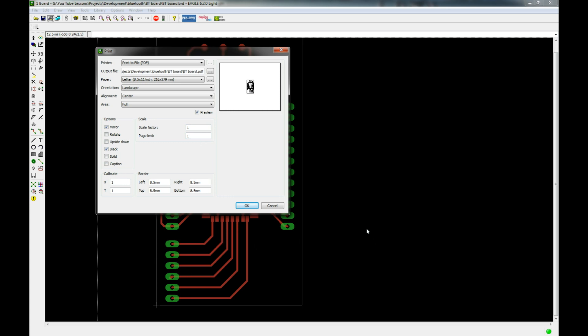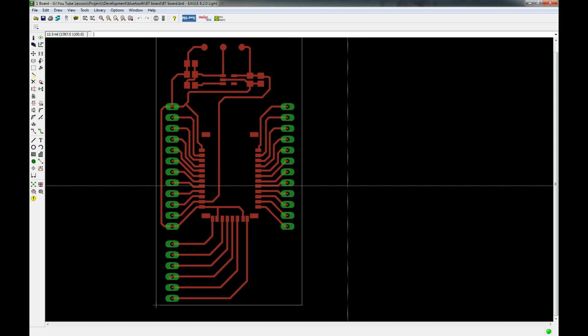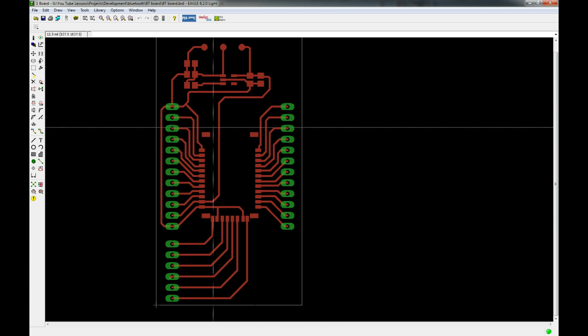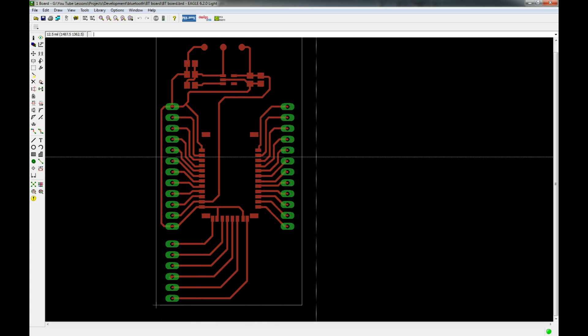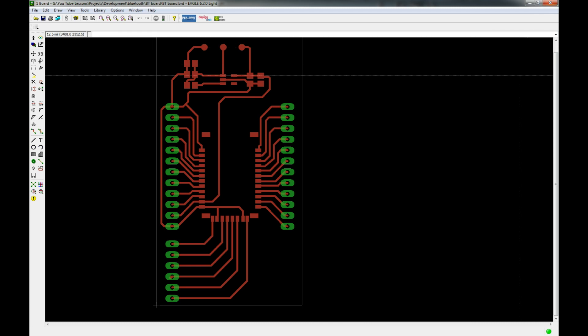Since you have to flip the board over to put it on the copper board, you have to print it out mirrored. What's cool about Eagle CAD is it has a mirrored option. The PDF you download from the project code link will already be mirrored, so you don't have to do anything — just print it out. If you want this exact footprint layout, just download the PDF, open it up, put the specific paper in the printer, print it out, and you'll have what you need to scribe your board.